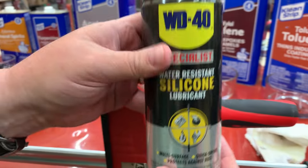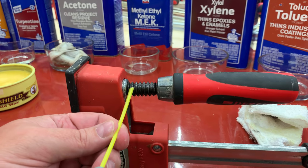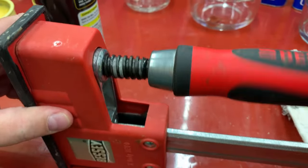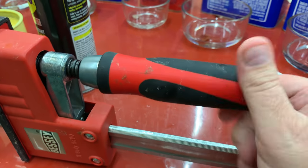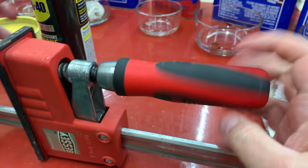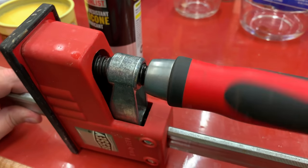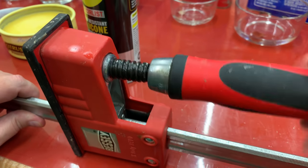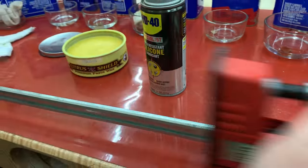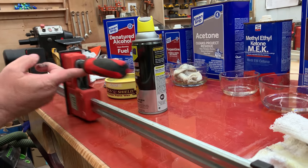Just one final thing I mentioned a minute ago: after putting the beeswax on those threads and reassembling the clamp, I like to put just a little bit of silicone spray over the top of the beeswax. This makes the threads move super smooth — there's almost zero friction on the threads now, and that really enables you to get a super tight clamping grip with minimal effort. So if you've got hundreds or even thousands of dollars invested into clamps, especially parallel clamps, you're really going to want to keep them in top working order, and this is the best way to do it. I have a link to everything I used in today's video in the description below. That'll do it for today — thanks for watching.